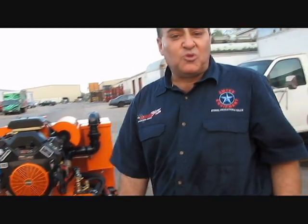It's a very smooth running, quiet machine. For any kind of cleaning, let's say carpet, tile and grout, water extraction, try to run the machine anywhere from 3,000 to 3,100. But if you ever want to do furniture cleaning, remember, with these engines, the faster you run them, the hotter they get. So to do furniture cleaning, I highly recommend, especially with a 30 horsepower, setting the RPM around 2,200 to 2,400 max. Because when you're cleaning furniture, you lose track of time.